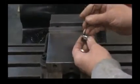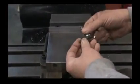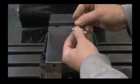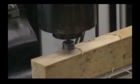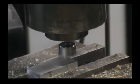Then I went to the belt sander, took a 3/16 high speed steel blank, and put a little grind on it so we can test it on some wood and see how she cuts. Here I'll assemble it, then back to the mill for a test cut on this wood — just beautiful. And it even cuts the heck out of aluminum as well.